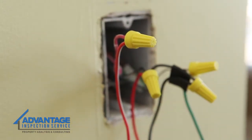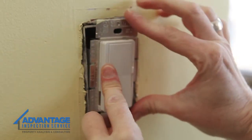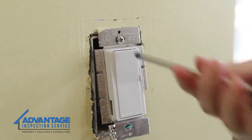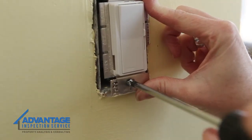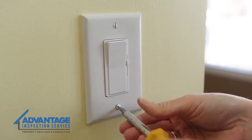Also, make sure you don't leave any bare wires exposed. If there are bare wires, make sure they are trimmed and capped with wire nuts. Once the wires are connected, push the entire switch back into the wall box. Realize that the new dimmer may be larger than the previous switch, so care must be used when installing the dimmer and wires into the box. Secure the new switch to the wall and attach the wall plate.